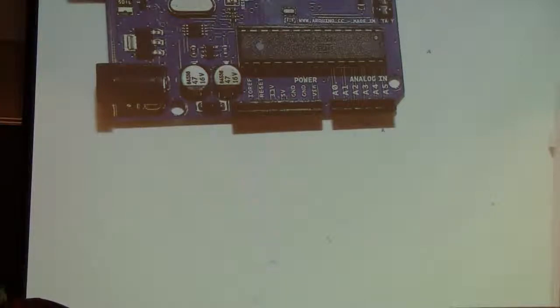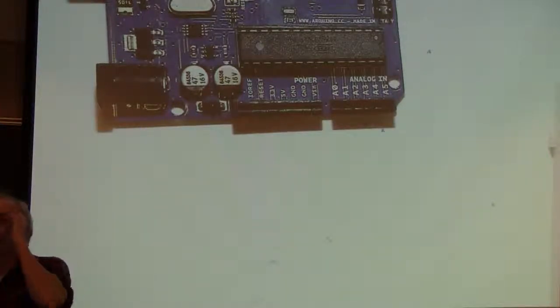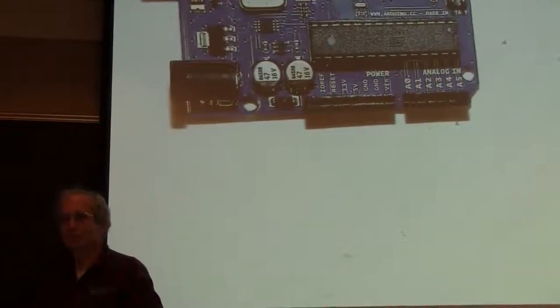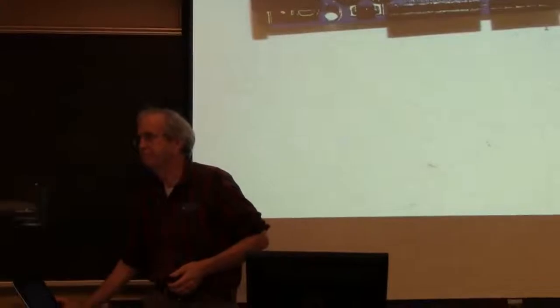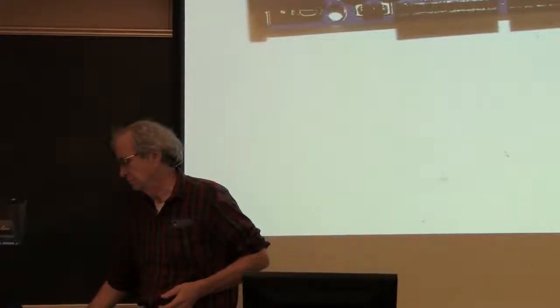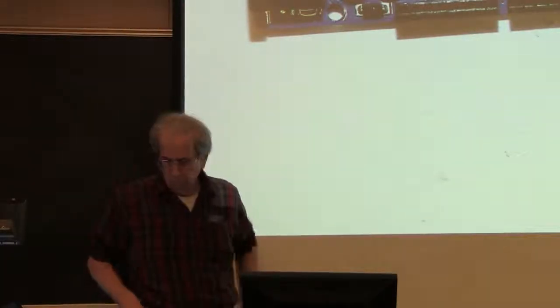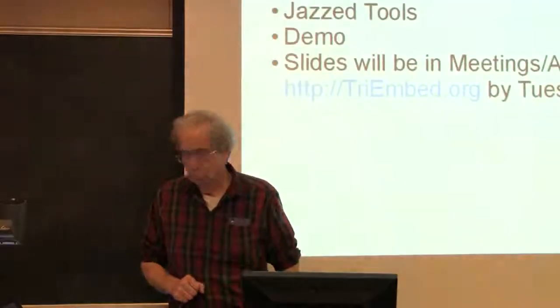Have you used the Pro Minis? Virtually none — almost not. Chip McClellan swears by them, that's his choice. They're super handy to drop in and twiddle a bit. I've either used the trivially simple ones or raw chips. The Pro Mini doesn't have a USB interface — it has an FTDI header, a voltage regulator, and a couple of LEDs. It's a very minimalist 328p implementation.